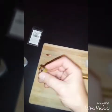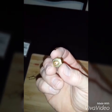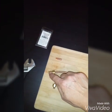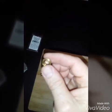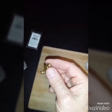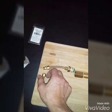And then this is the actual tip, 0.6 millimeter in size, and this is actually used for a welder. What I did was I cut it down — this is what it normally looks like, it has threads on the end. I just cut the threads off because you won't be able to fit it into the housing here. Be very careful with those tips; you really shouldn't be touching it with your fingers because it contains lead. So when you're cutting it, make sure you have a very good filtered mask on and safety glasses, because you don't want to get that on you or breathe that in.